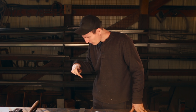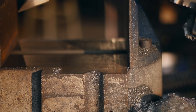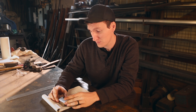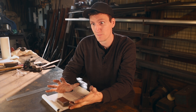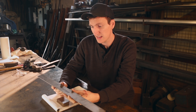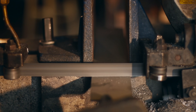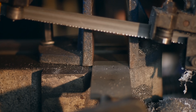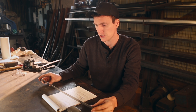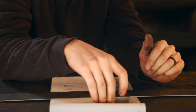But for now, let's take a look at what's going on. I'm just gonna sit down and we're gonna talk a little bit. So I've actually had this idea in my mind for a while, trying to figure out what materials to combine together to get this aerospace Damascus. I don't know if you could classify it as Damascus, but basically trying to forge weld two aerospace steels together. This is the niobium, and this was the first material I wanted to try to play with because it has a really high melting temperature — 4,600 degrees Fahrenheit — which is crazy. It's used in rocket nozzles or places where you need extreme strength and high temperature applications. So I was looking for other materials with a similar melting point so we could forge weld these together, and that's why I landed on this mar-aging steel.